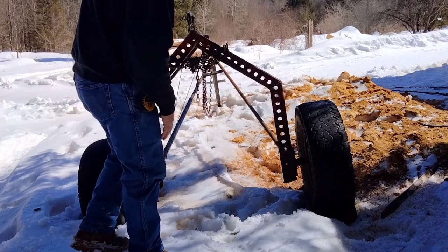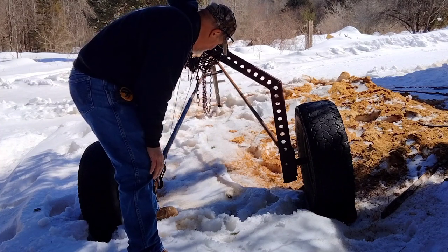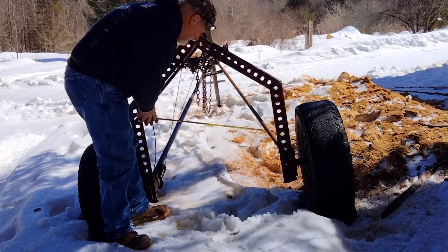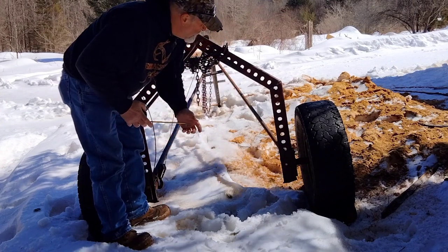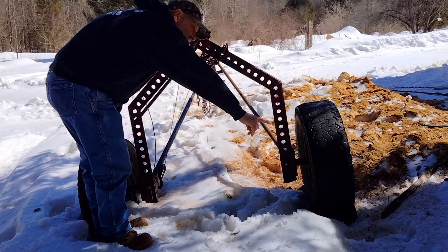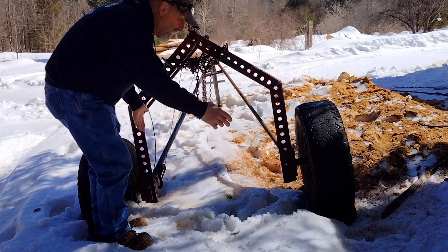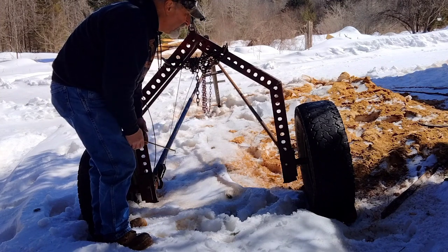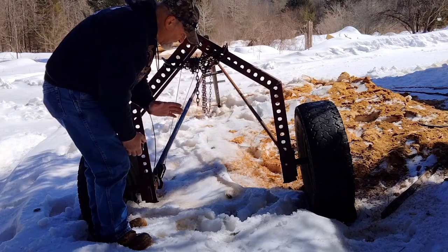That covers all the mistakes. After we got those straightened out, everything else worked well, so now we're getting into dimensions. This one is a little wider than Tim's. You're unlikely to carry anything bigger than 24 inches, which is a pretty good-sized log. This one is 34 inches inside to inside, so I built it wider than needed. Tim's isn't as wide and he has an easier time maneuvering through the woods. If I were to build another one, I'd build it narrower — no wider than maybe 28 inches.